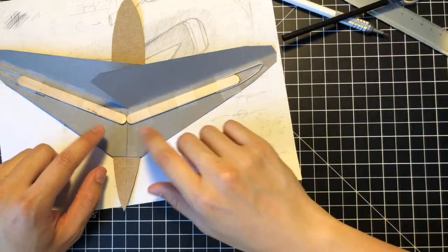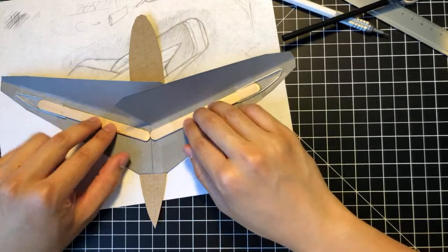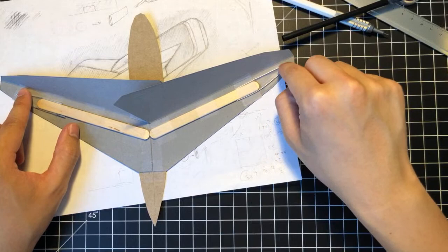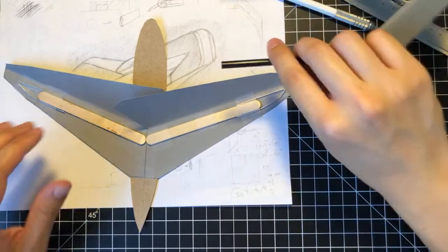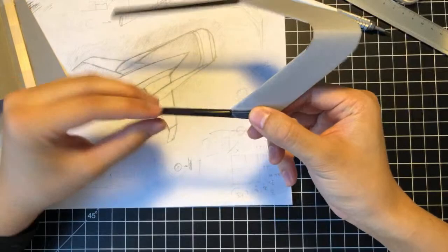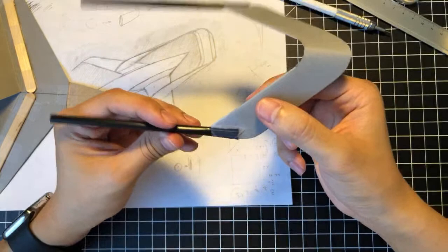We took the templates, taped them together, taped the assembly to the fuselage to just kind of tack it in place. We mounted the spars in 3 locations each, and then we mounted these paper clips to the winglets so that they can be shaped into that nice bend later. And we built the tail assembly today, which is really nice. It actually turned out a lot better than I expected, considering this is a new method of integrating the spar with a flat piece control surface.